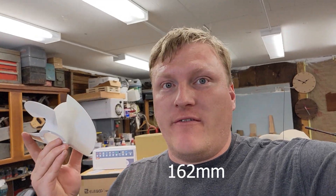This is PLA material — it should be plenty strong for the purpose. This is Seth Johnson at Landahouse; he is testing out a turbine that's smaller than this. This one is 6.4 inches, while Seth's is a 4-inch turbine estimated to flow around 100 gallons per minute. This 6-inch turbine I'm hoping flows at 500 gallons per minute, which I estimate at about 40 watts per foot of head.